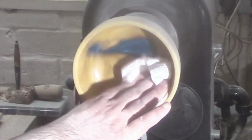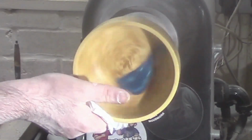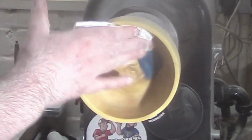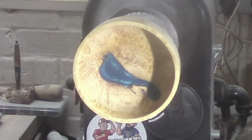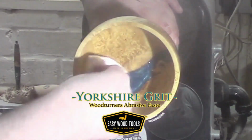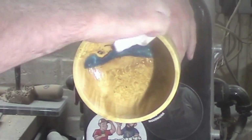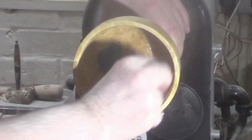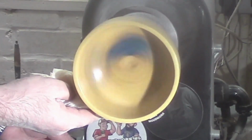Clean the surface off with a bit of methylated spirits or denatured alcohol. Some Hampshire Sheen matte sanding sealer. And some Yorkshire Grit abrasive paste. There's links down in the description as to where you can buy this. There is UK and US distributors. Just buff it in until you get a clean paper towel and you'll have the equivalent of 1,000 grit.